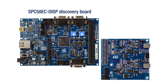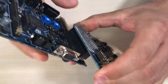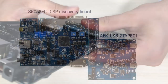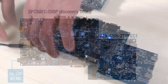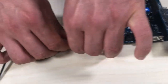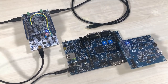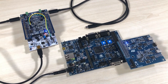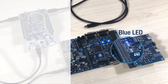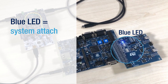The first step consists in connecting the interface board on the Discovery Board 4x37 male pin connector. The second step consists in connecting a 1A 12V AC/DC power supply and switching on the Discovery Board. If the connection is correct, at Power On you shall see a blue light indicating power to the interface board USB Type-C One. After waiting around 5 seconds, the blue LED on the respective port will start to blink.